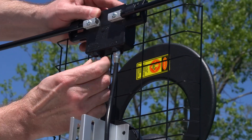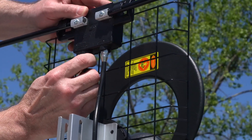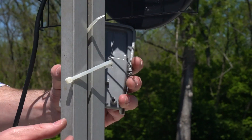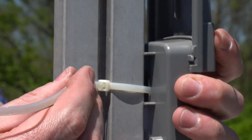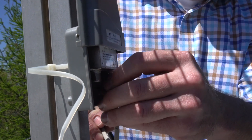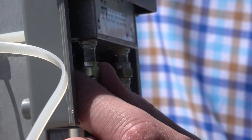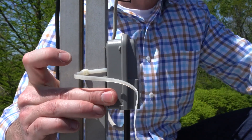Connect the provided 3-foot cable to the UHF-VHF out connection on the VHF assembly. Next, slide open the lid of the preamplifier by pushing up on the front panel. Attach the preamplifier using the zip tie to the front pole of the elevating mast and pull the zip tie tightly around the elevating mast. Attach the cable already installed to the elevating mast to the out port on the preamplifier, then attach the other end of the 3-foot cable to the in port on the preamplifier. Close the lid by pushing down on the front panel.